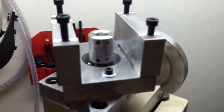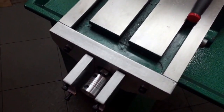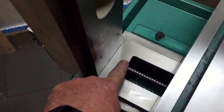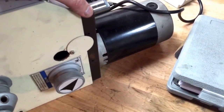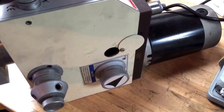Before I hook up the motors, I'm going to do a bench test on the motor system and controller with the software and all the new configuration stuff. We pretty much got everything in place. In the process of milling the massive three-inch deep hole I had to put here for a one-inch gap, I ended up destroying the motor gears. I shaved off the plastic gear that's in here. So now I've ordered a pulley modification to make it pulley driven instead of gear driven.